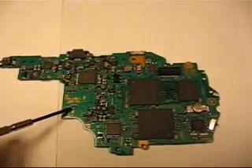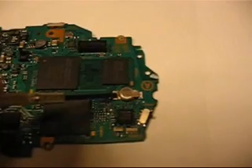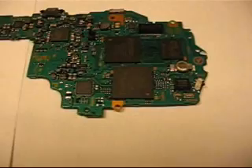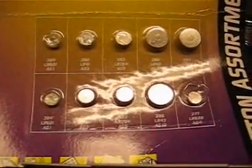This little thing here is the PSP motherboard, and this shiny little thing here is the PSP motherboard's backup battery. In this particular motherboard it's dead and I need to replace it. I'm going to use this soldering iron with a tip filed flat, this hookup wire, and the battery itself will be replaced with this button cell battery, or one of these.